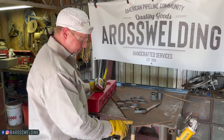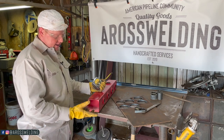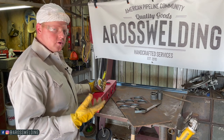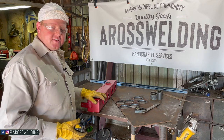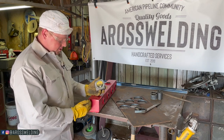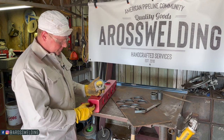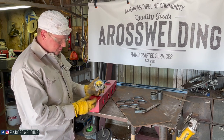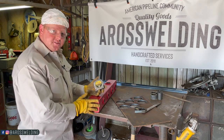So I've got some 1/4-inch plate here, and the way I want to weld this on, I can do it one of two ways. A lot of times if I'm doing something for visual only, like handrails or something where there's no pressure inside of it, I will take my measurement on the inside of the new square tubing, and I'll make my cap just a little bit smaller. That way I can get a good penetration around it and still sand it down.